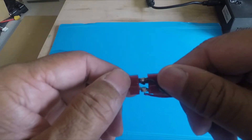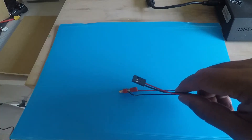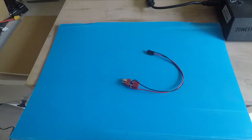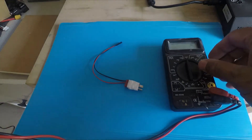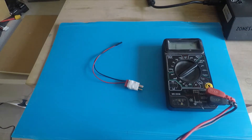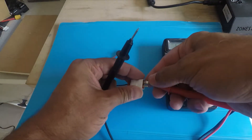Then we take two wires out to a Futaba-type RC connector to which the rest of our circuit will be connected. We put electrical tape to isolate the soldered junction from any external short. Let's check if the soldering is done properly — there's no short on this pass-through connector and the attached Futaba-type RC connector.